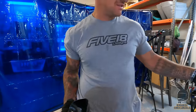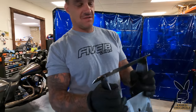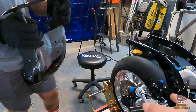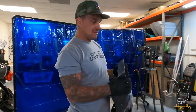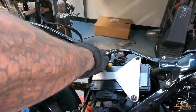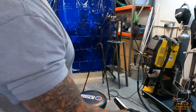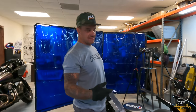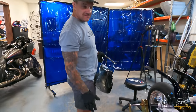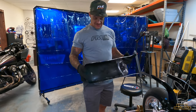Dude, you can really see how these rails back here are bent from when I jumped it, and this is on the bike now, because this makes it very noticeable, which kind of sucks. And that was before you put the shocks on, right? You jumped it before that with the mono shock and it's still bent? Yeah, so the mono shock bolts up to this rail up here. I think it just pushed this guy up and out. You did land a little heavy on the left side too. That I did, real, real heavy. Also bent the fork tubes, bent everything. The whole suspension went to shit on the bike when I jumped it. And I only got like that much air probably. But I did flat land 700 pounds, very rough. So, I mean, that's it. I'm gonna grind this up, take it down to Steve-O.